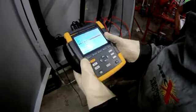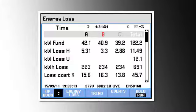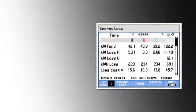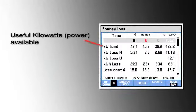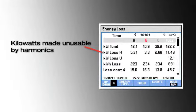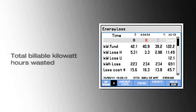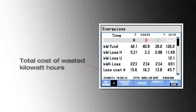This is what I wanted to see. This is the new unified power reading that our engineers were telling me about. They said this new feature quantifies the energy waste caused by harmonics or unbalance — not just measures it, but actually calculates how much energy is made unusable because of harmonic distortion. I could input my utility rate into this and it would tell me in dollars how much energy we're wasting.